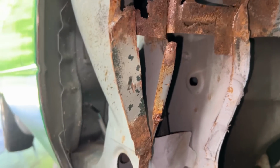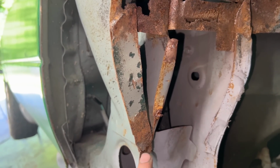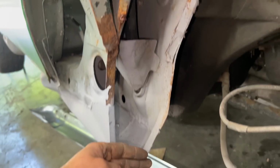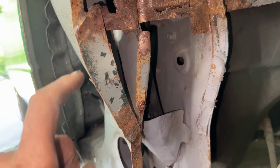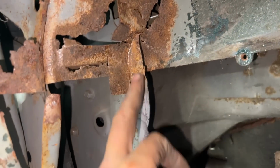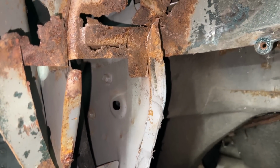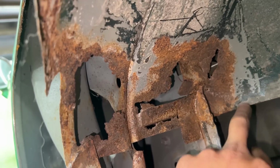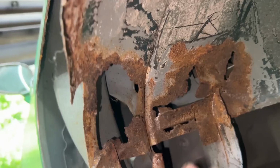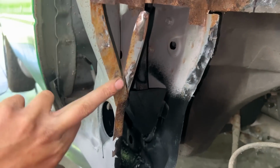For now, I wanna get rid of this flange here, because that's the remaining piece from this cover that's coming here, which is also complicated. So we need to get rid of this and of this here. You see, it's all spot welded here. So we're gonna remove that, and then we're gonna start maybe with this one first, and we'll see about that later.